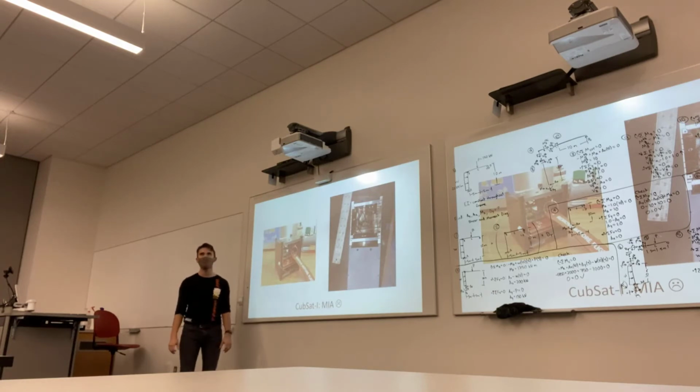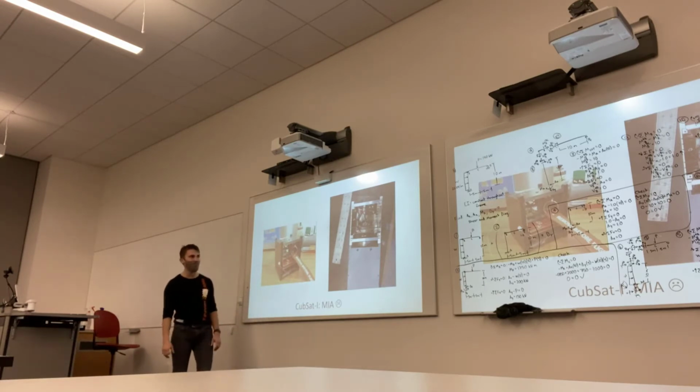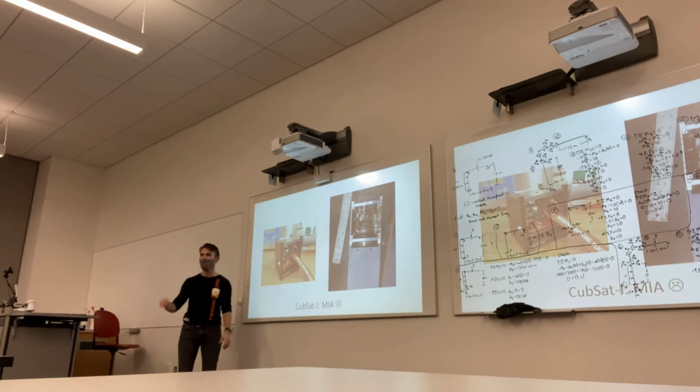We were hoping some of the GPS units on there had SIM cards, and they can survive some pretty high G forces. Maybe those survived. Turns out we were in the middle of the Mojave Desert, and there is no cell phone service out there. So even though we have 3 of them, they're completely dependent on one point of failure. If you learn anything else, if you're going to have redundant systems, make sure they're not all dependent on the same common point of failure.